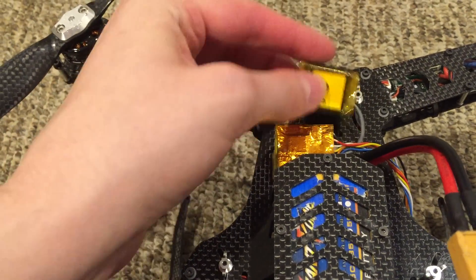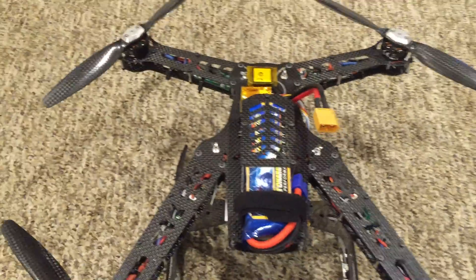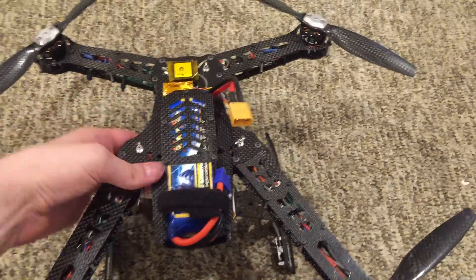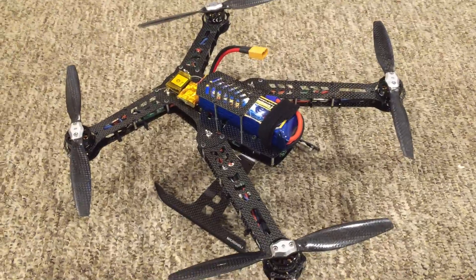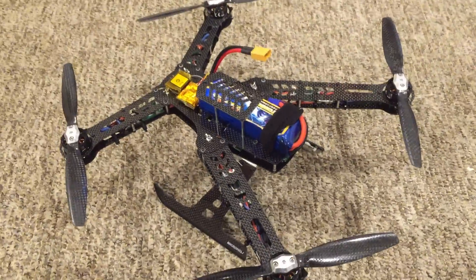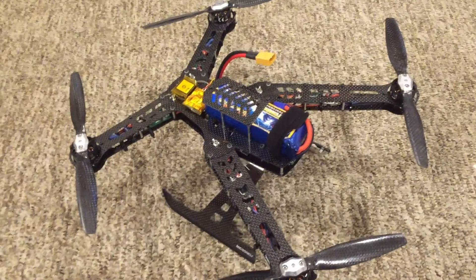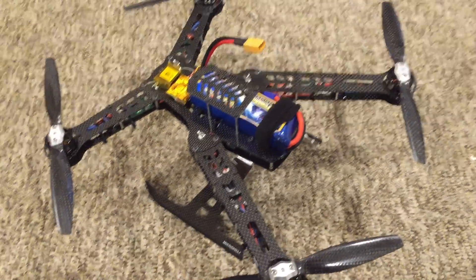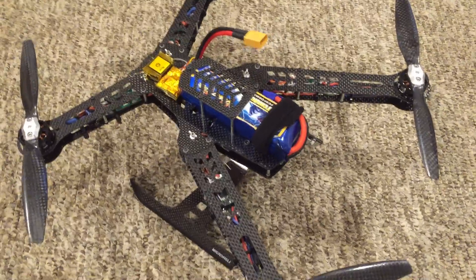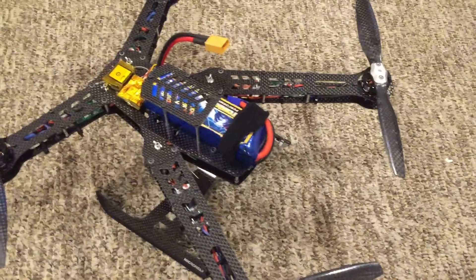You can either use sticky tape or a little Velcro and you're pretty much good. That way, when the quad flips, the stress doesn't instantly go onto your GPS electronics. GPS is extremely stable with the carbon fiber — to my knowledge it doesn't affect it at all. If anything, I actually get a much faster lock than with the plastic body, I guess because it's not covered up.